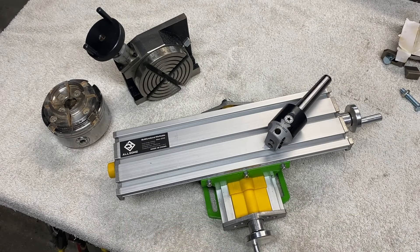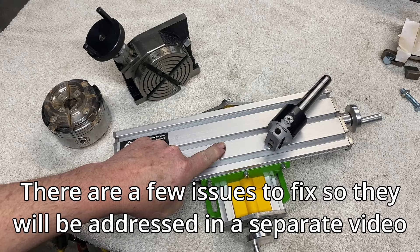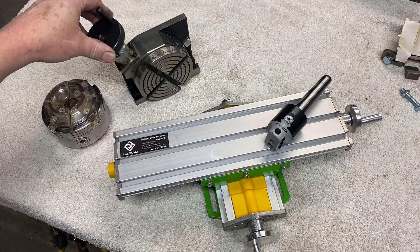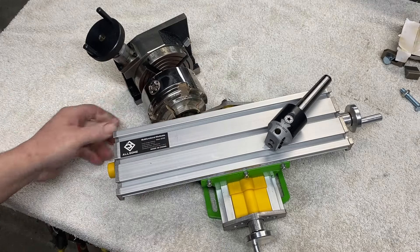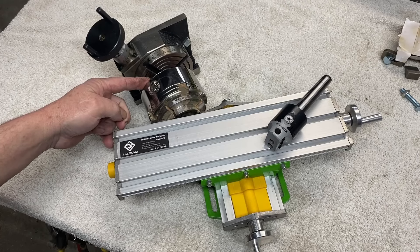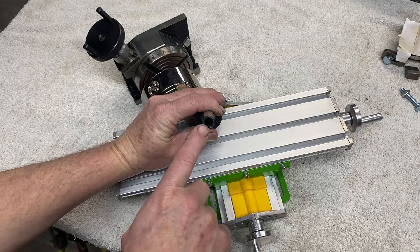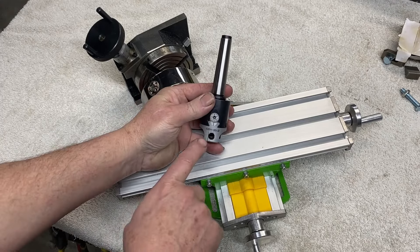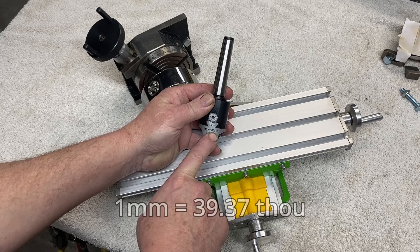As you can see I've been shopping. There are a few things I have to make — one is that substructure. However I have bought a standard XY table here, and I have identified an issue I'll have to fix during the video. I've also purchased a small rotary table and it does have mounts to stand up on its end. The chuck will be connected to the rotary table and I have to make the adapter that goes in between. I have the one and a half inch boring bar and it does have a thread in there so I can tie it back in the spindle. The only issue is that this is an imperial boring bar — one inch — so I just have to remember that one millimeter is 39.37 thou when I'm using it.